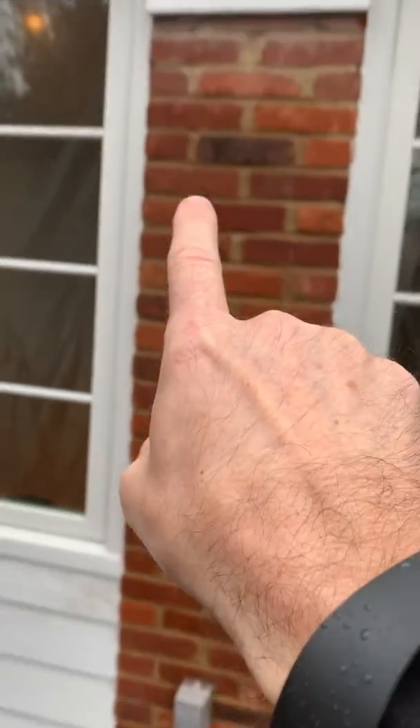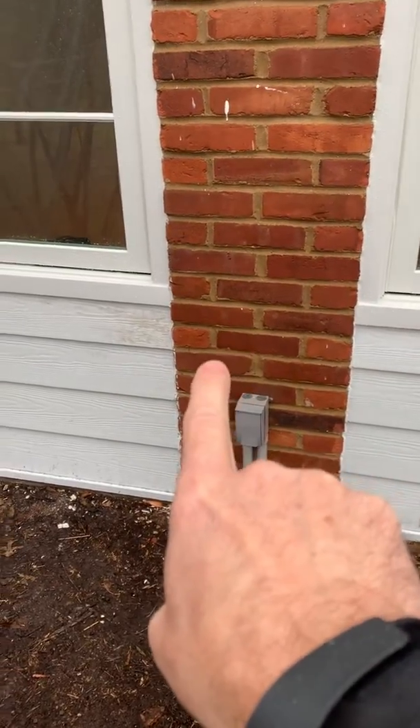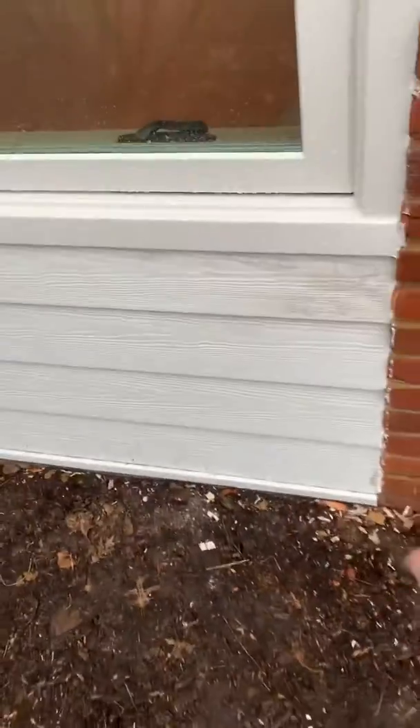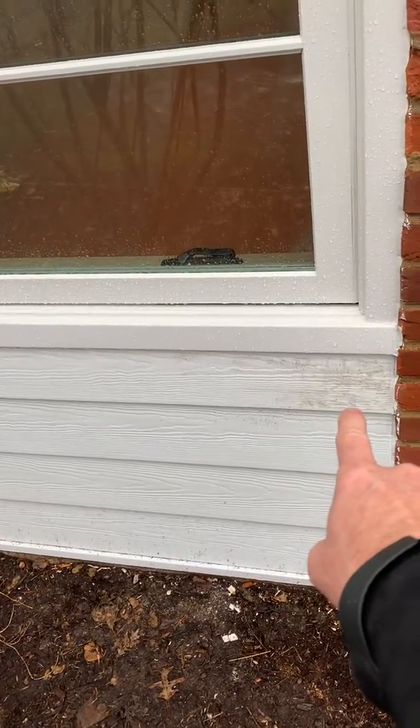That's going to run down the wall. Right above this outlet will be a disconnect that's provided by the electrician. At that point, we're going to make our turn just below here, so our line hide comes just below this. That's where our electric will go into. We'll run our 230-volt from the indoor unit, with our high voltage running over.